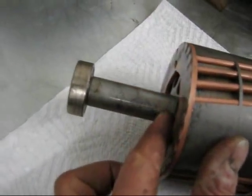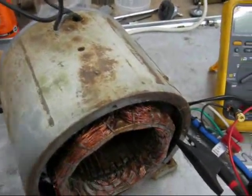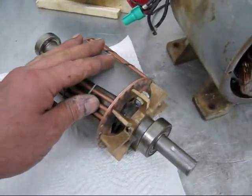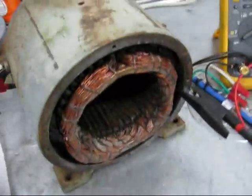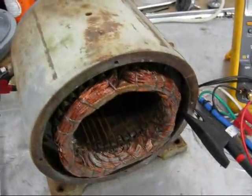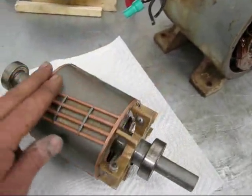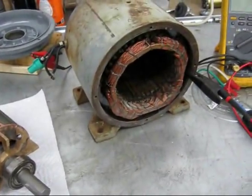Another thing — it looks like there was never any sort of centrifugal start switch on it anywhere. I don't have it here, but it had a really big box on top. It must have had some kind of potential relay or some other way for it to kick out the starting phase. I'll figure out a way to make it run tonight for a quick test. I'm going to have to study up on how this is supposed to be wired and the story on this rotor — I've never seen one quite like it.